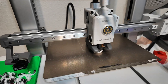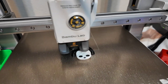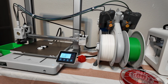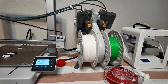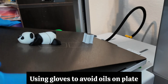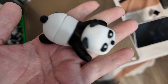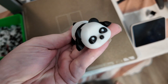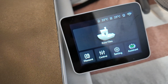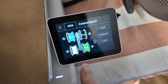I've had no issues with the Toybox really except for maybe Wi-Fi losing connection, but more things can go wrong with the Bambu. That said, the actual quality is way better and it's just overall a better printer. One thing to note — filament can get tangled, especially if you let go of the end and don't wind it right. With the Bambu it will pause the print and you can fix it, but if the Toybox gets tangled it will completely mess up during the print and you have to start all over.